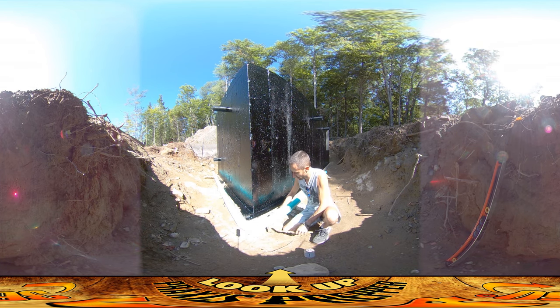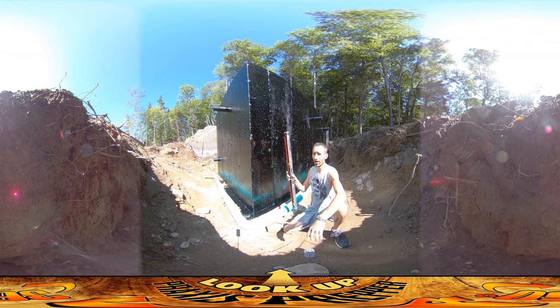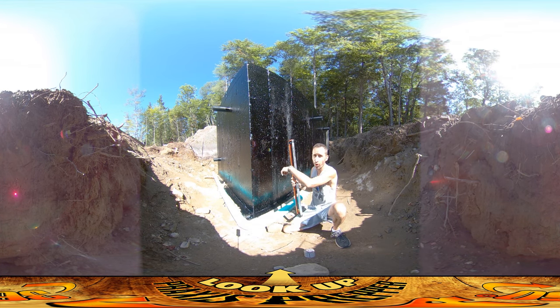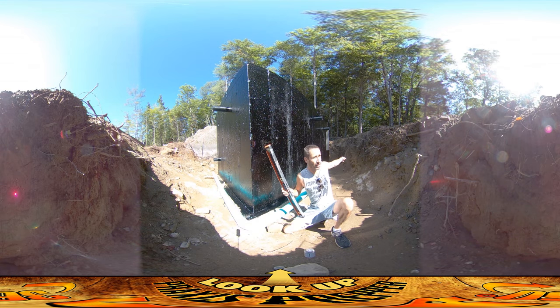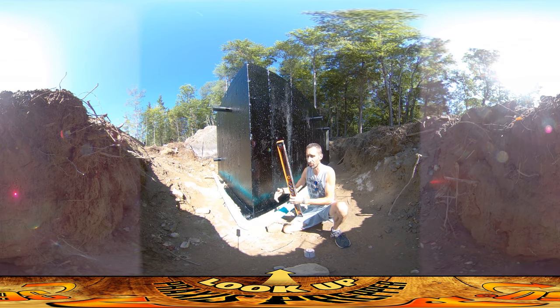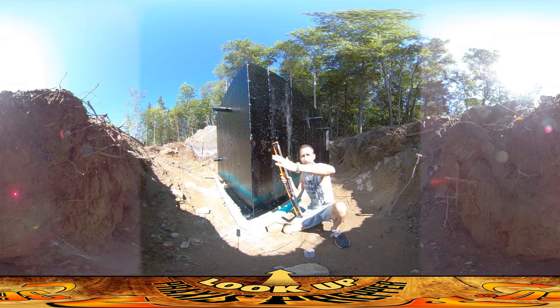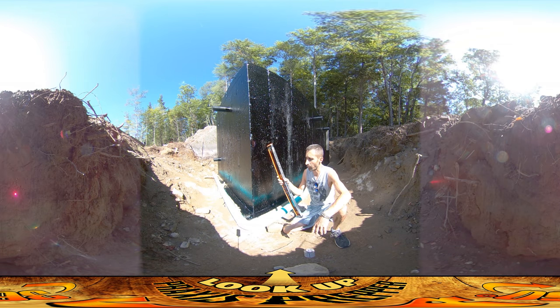I've got these little sticks I can use to prop the pipe up, and a level to track my progress. My plan is while they're excavating over there, we'll dump some gravel around the pipe, then put a fiber barrier to keep silt and sediment from getting in. After that, while they're excavating to make the daylight drain and bring the landscape down, I'll just have them dump gravel directly here - more efficient that way and it'll keep them moving faster. That's it, thanks for watching.